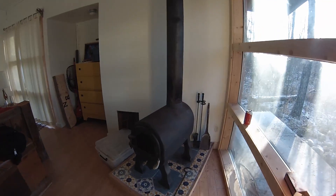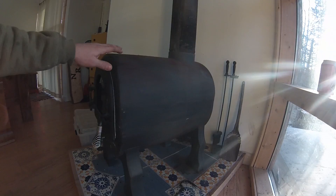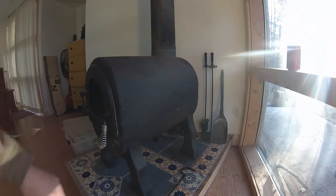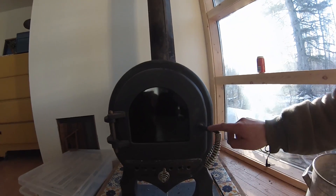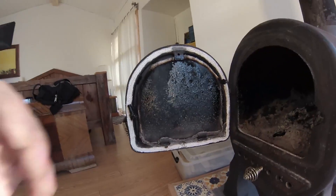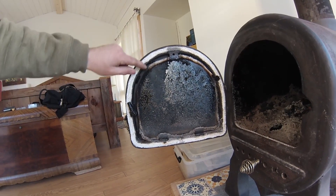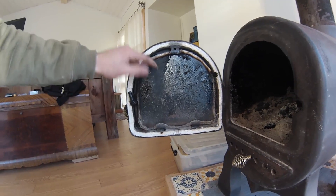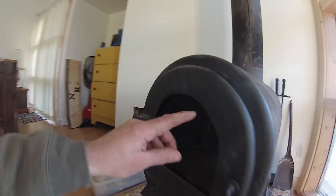This is the third wood stove. It's built out of a large piece of pipe that I cut in half and welded a section into, which gives it that oval look. This one's a little more finished — it's actually in the cottage I'm currently sleeping in, so it's running right now. The door handle is made out of just an old welding slag hammer. The door itself is just plate steel with round bar welded, and that's where the seal goes. The glass is held on by these little tabs and it's all ground smooth.